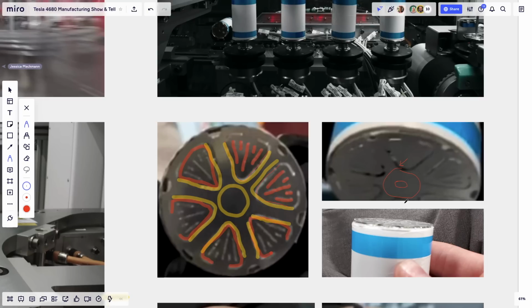Of course, once we get to why they did it that way, then we might have some conjecture and speculations. But this is very clear from the geometry. They left 6 branches. So this is one branch, this is another branch, this is another branch. And you have one down here and you have one here. So you have 6 branches that are welded on the opposite end of the disc. The welds are here, on each segment, you have the welds. But this center part can move.